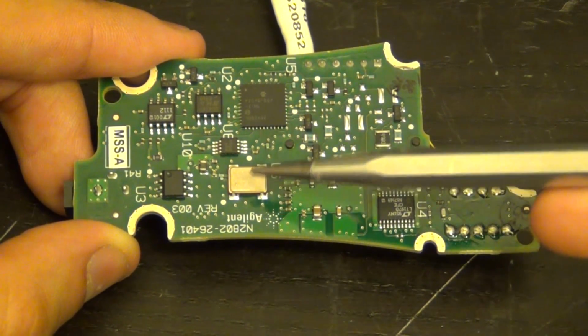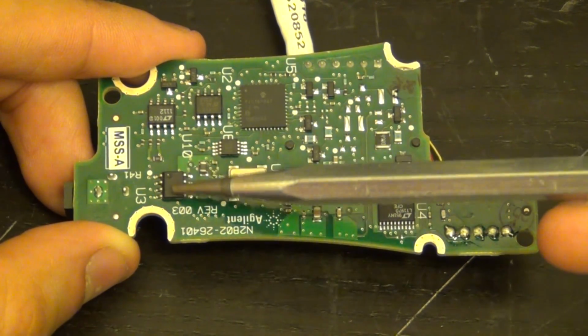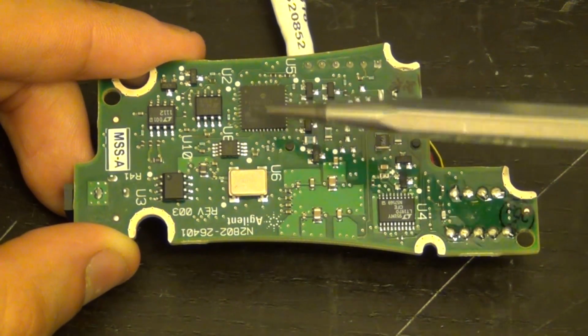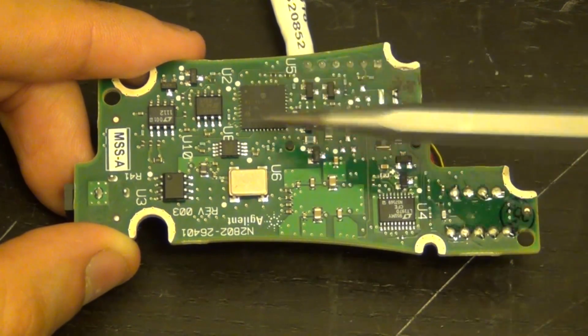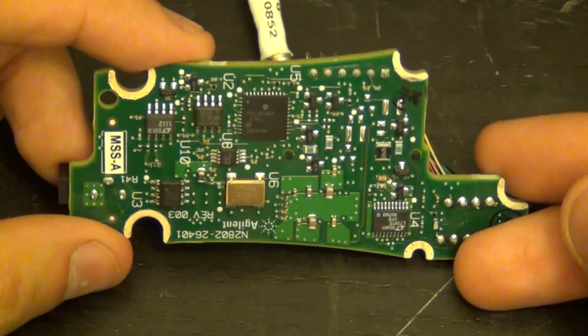This is the 20 megahertz clock oscillator. This is a CMOS switch. I forget what this was. I believe this was another op amp. And here we have a PIC microcontroller, PIC 18F877 or 16F877. One of my favorite PICs. Actually, I've used this one quite a lot. I was a little bit surprised to find that one over here. But you can see the design is pretty straightforward.